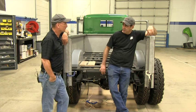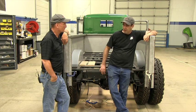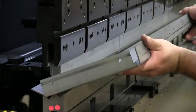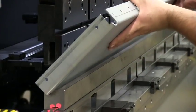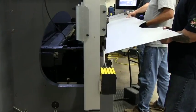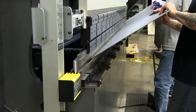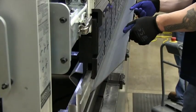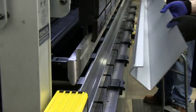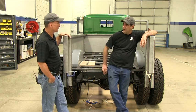So once you got all the metal cut, what was the next step? Well, this is 11-gauge steel, so after that it had to be loaded up into a press brake. With some of these longer pieces — the 10-foot pieces — it was a little difficult because they're heavy, so you've got to get it in the machine just right. You can program it for what degree of bend that you want. Once the bends were made, we're back out here to attach them to the framework of the bed.